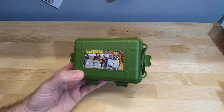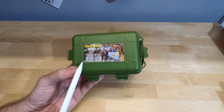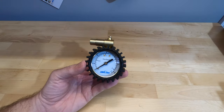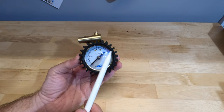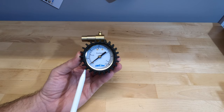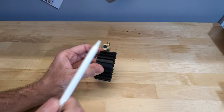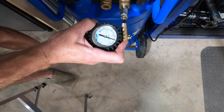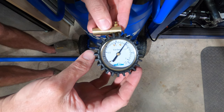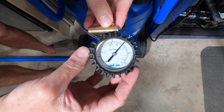The third analog gauge is by Godesen and comes in a cheap little box. Inside is something similar to the AccuGauge — a clear face reading 0–30 psi, with a protective shock boot, a brass head with a pressure release valve, and it's for Presta only. All three readings came in at 19.5 psi — very consistent, though half a psi low.